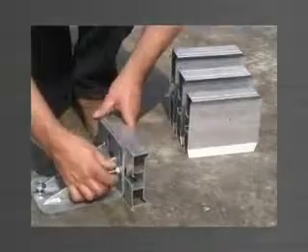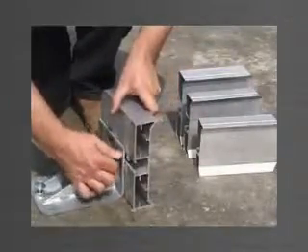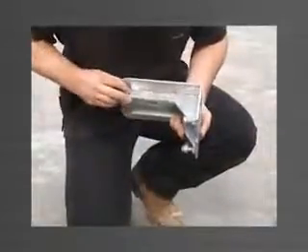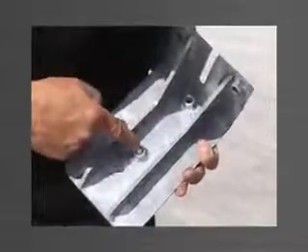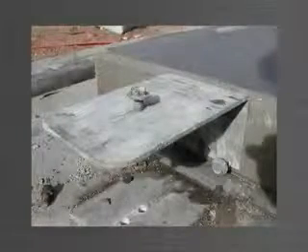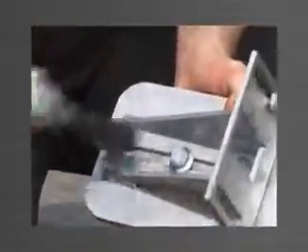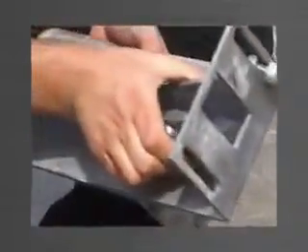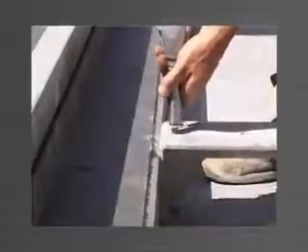The top bracket does not protrude above the 125mm edge form, yet will still engage the 200mm edge form. The bottom bracket is used to support the top bracket and edge form when forming the next panel. The bottom bracket is strengthened with a full-length gusset and has two nuts welded to the underside, which act as anchor points to fix the top bracket. A flanged head purlin bolt is screwed into the back nut — this bolt can be left in the bracket at all times. The keyhole in the base of the top bracket is placed over the purlin bolt, and the top bracket can then slide forward to the correct position and be locked in place. In the event of a panel reducing in size by up to 300mm than the panel below, the purlin bolt can be transferred to the front nut, allowing the top bracket to slide further inward, reducing the size of the panel.